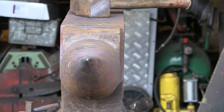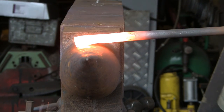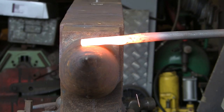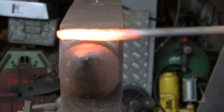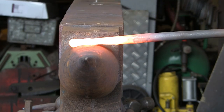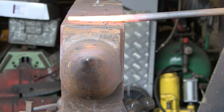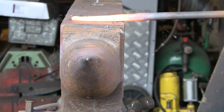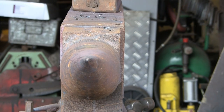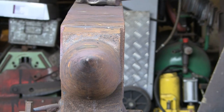I'm doing this one on the other end of the same bit of bar, just looking at it from a different direction — see how much metal gets moved. This is actually a very long piece; it's going to be about six foot or so long, and I haven't got enough room between the wall and the anvil to actually do it. So I'm just going to make them in short lengths, cut them off and weld them onto a longer bit of bar. Just makes life easier. If you've got plenty of room you can do them both on the long bar if you can get your measurements right, but I tend to do one on the long bar and then a short one and weld it on to get the exact measurements.